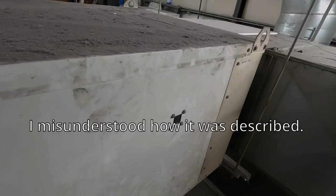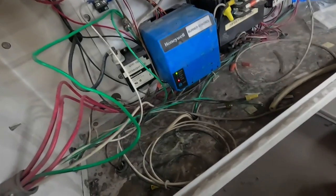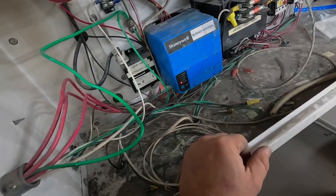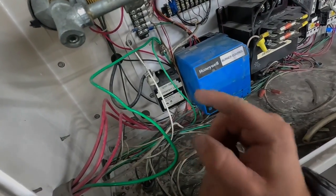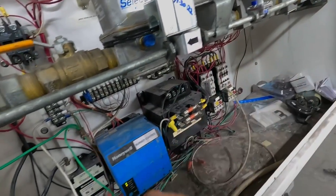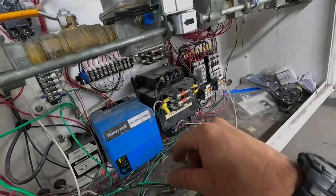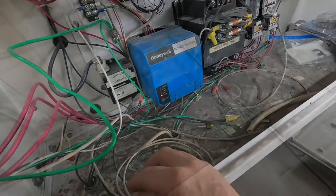That's opposite of what we want. So maybe it was right — darn it, I was hoping it was wrong. My interior is pilot and it just alarmed out. I've checked my spark there, it's working fine. We just replaced the solenoid here — I thought maybe it was sticking. I made sure my regulator was replaced, thought maybe it wasn't doing its thing. So there it just took a dump. I put it in bake mode — in bake mode it's opening up. Yeah, it was right the other way. We've got to change that back.